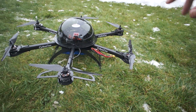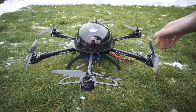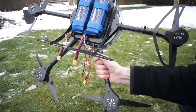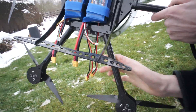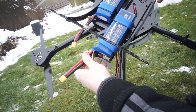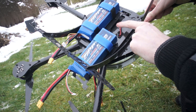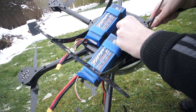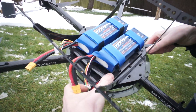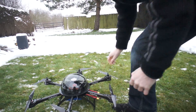So we're ready to fly the CarbonCore Hexacopter 650 with a tail fin, which is very helpful because when you look at it from a distance you can really tell what way around the hexacopter is. We have two 4-cell 5000 batteries and they slide out that easily. This particular hexacopter has two pairs of wires which are extra wires for the power of a gimbal — they're insulated at the moment but can easily be used for pairing a gimbal or some AV transmission equipment.